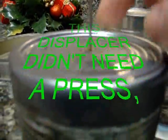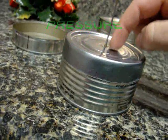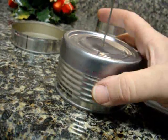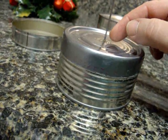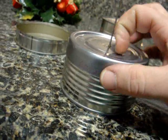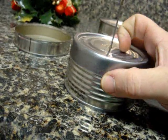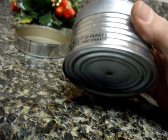When you're done, you want to fill the sink with some hot water and then — long after the glue is dried — you want to submerge this and see if any bubbles come out. The air will expand and put pressure on it, and if there are any leaks the bubbles will appear and you'll know exactly where it is. Take it out, dry it off fast before it cools off and sucks water inside. You do not need water or moisture inside this.